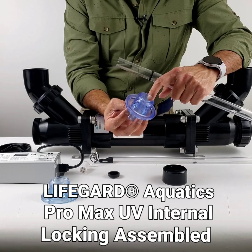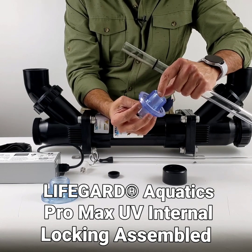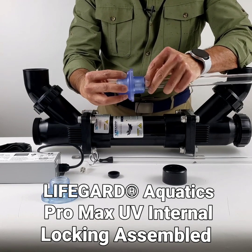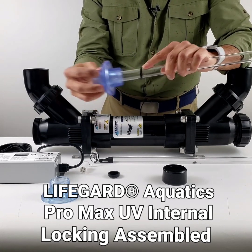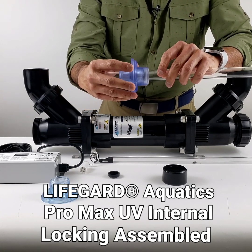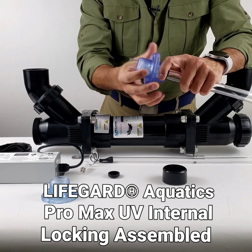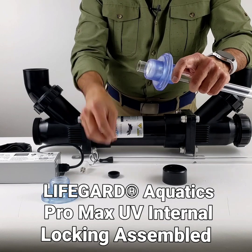Once this slides in, keep in mind the flat gasket goes in the part where the groove is thinner — not so deep. This goes in here, and you can see it will fit on this side. If you do it by mistake on the other side, it's too deep, so that is the wrong way to install it.